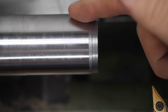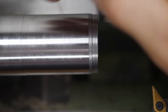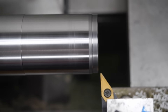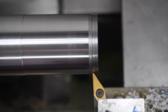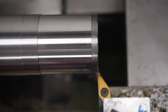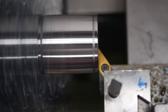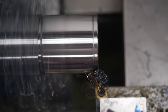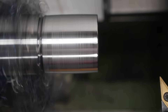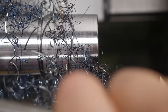Because this is a flat belt pulley for a grinder, the next step is to turn the outer diameter to its final dimension of 42mm and put a curved crown onto it. We'll also put a little chamfer on the end ready for cutoff. I reduced the feed rate for the final finishing cut but it was too little — it was a much nicer surface finish on the earlier cut. We've tweaked the toolpath so the next run will have a much higher feed rate like during the roughing pass, which gave a beautiful finish.